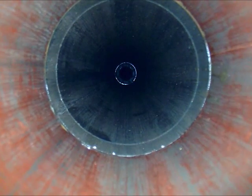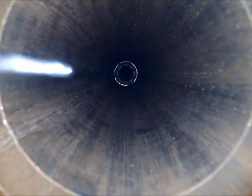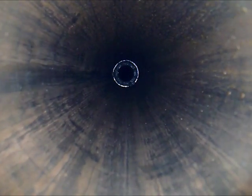After a retrieval tool was dropped onto the SSSV in a well in the North Sea, the slickline operation experienced trouble landing the pulling tool. When back at surface, the dogs in the tool were found damaged.